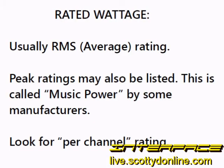When stereo buffs get together, you'll hear them talking about their amplifiers and receivers, and wattage inevitably comes up. What do these numbers actually mean? Wattage is basically an expression of the power the amplifier generates as it amplifies a small signal to a larger signal that can be used to drive a set of loudspeakers. It's expressed in watts. The more watts an amplifier has, the louder it will be. However, higher wattages do not necessarily mean better audio — wattage doesn't tell you anything about what the audio sounds like or how much distortion the amplifier is producing.